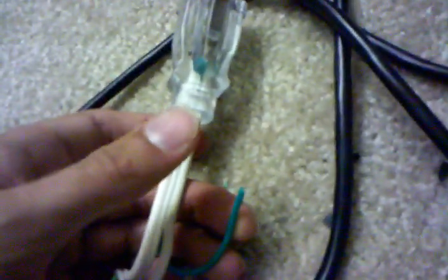When you splice the connection cord, you don't have to worry about the green wire at all — it's not used. It's preferred that you use it, but you don't really need it. You could hook it up to the ground, but if you did, the light would stay on 24/7 while your fog machine ran. If that's your goal, I don't suggest doing it yourself — just use a cheap adapter that splits into three or four outlets, unless you're an electrician.